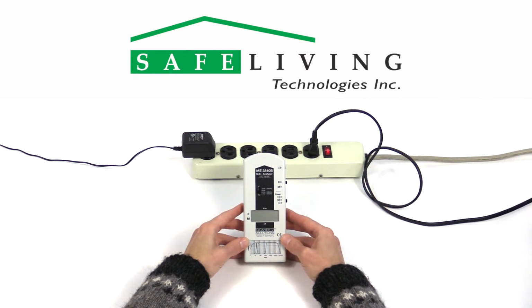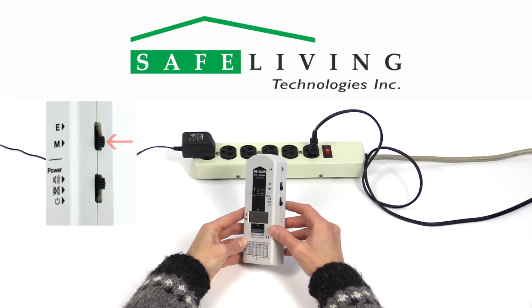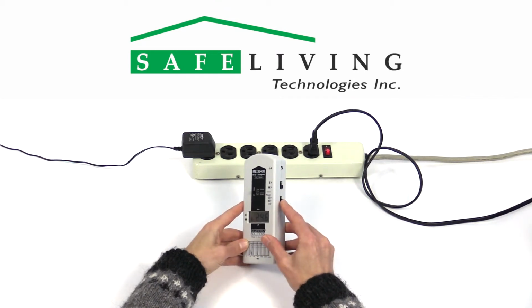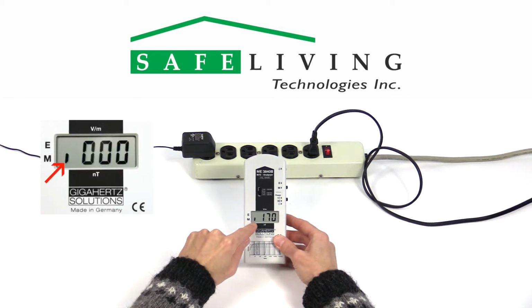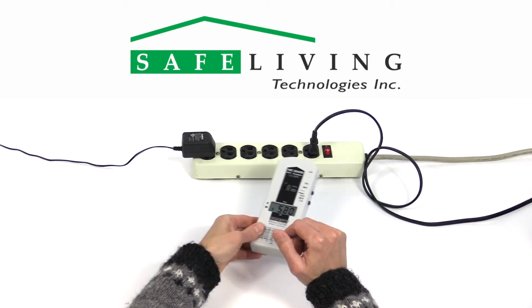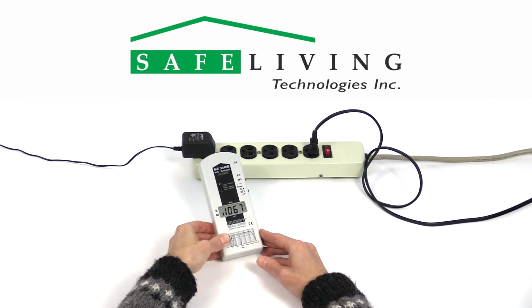To measure AC magnetic fields, set the field type switch to M, set the frequency range to 50 Hz to 100 kHz, and power the unit on with the sound option. Note the indicator in the display next to the M showing that you are in magnetic mode. Slowly scan an area and follow the direction of the highest field strength. The Geiger counter tone will also increase closer to the source.